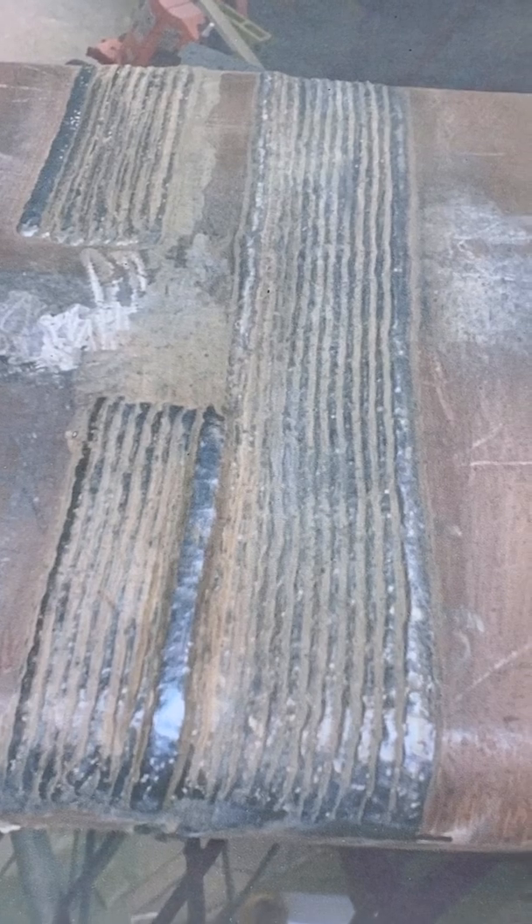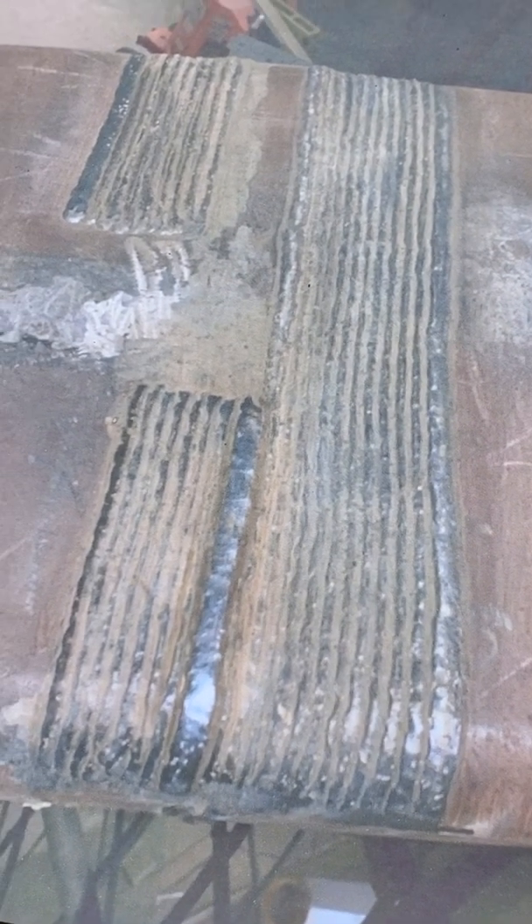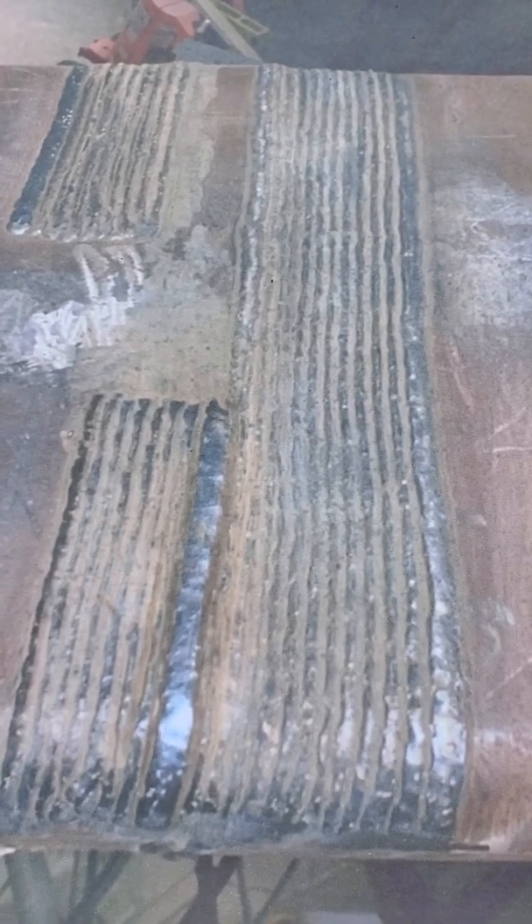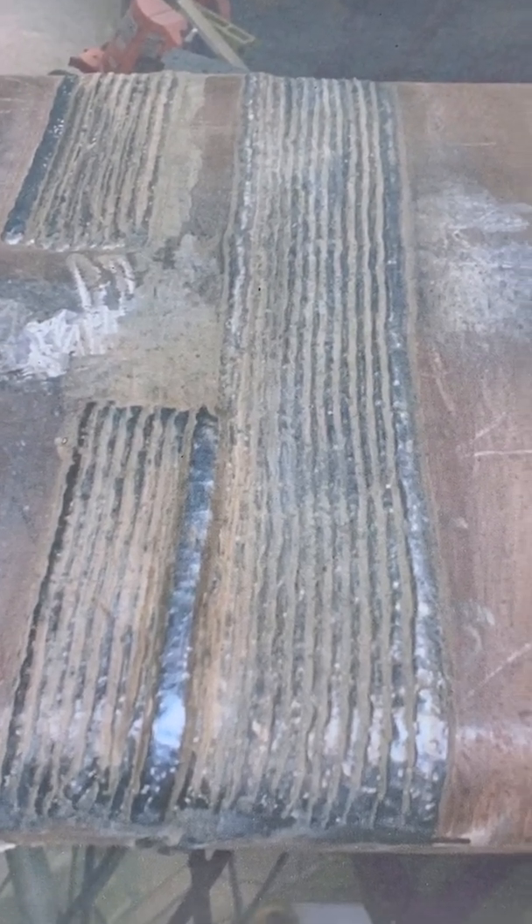Excellent job. I mean, 233 — you can really push it as a flat, but it's 564. If you're running 16th, just — whatever, that's just my opinion, but 564 is the way to go. NR233, it's all position — you see he has beautiful wraps. Look at them. The inspector is so happy. I don't know how many he had to do, but this is what I'm talking about: all-position flat.